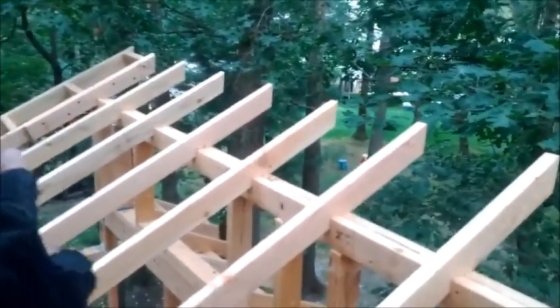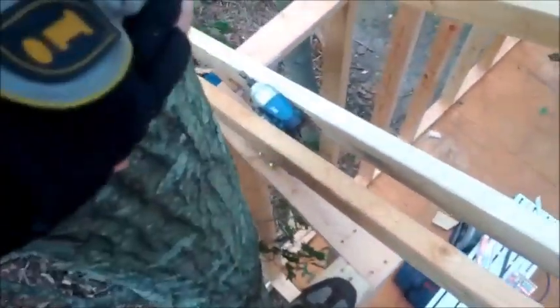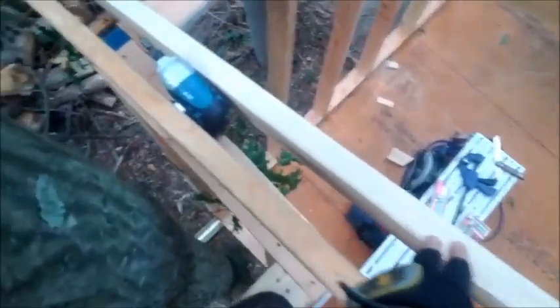These are all done up to this notch here where the framing goes around the tree. The one that fell 16 inches on center is here, just a few inches from the edge, so I just set a second one right on the edge.